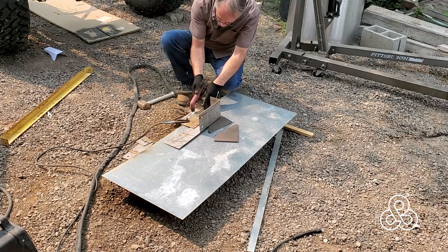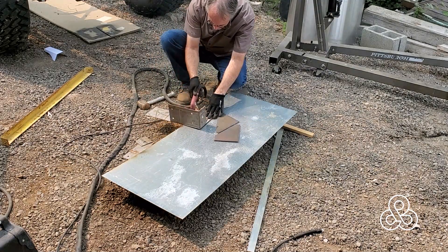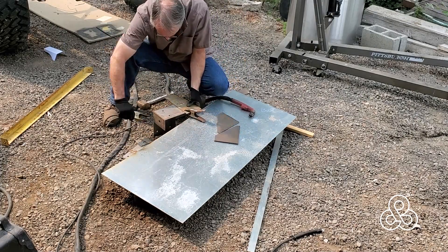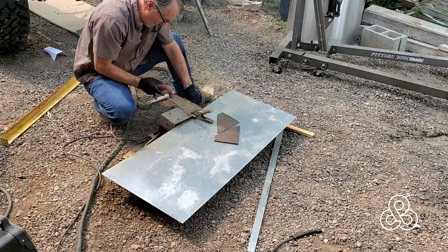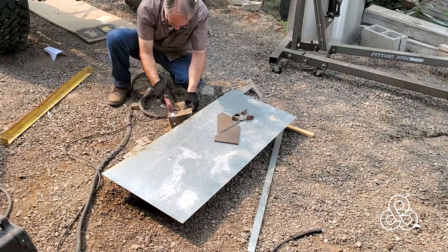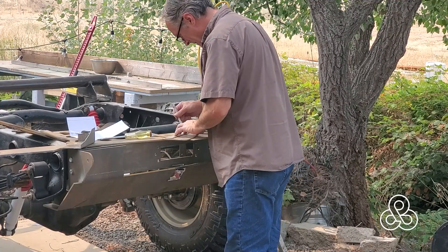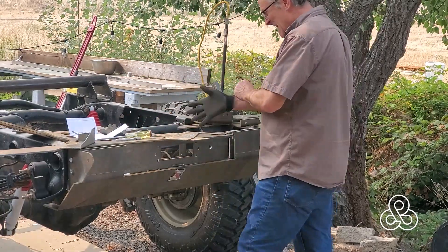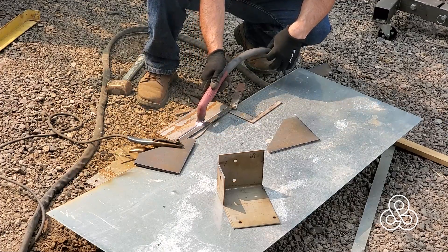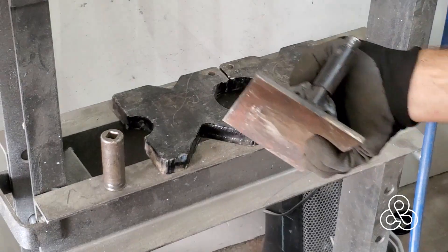To install the fuel tank, I'm going to attach it to a couple of the crossmembers of the chassis. The two frame rails are joined together by these three-inch round tubes, and I'm going to build a bracket that will hold the fuel tank and keep it spaced down at level. I had a couple of heavy sheet metal brackets built for the front of the vehicle that I'm not going to use, so luckily they were pre-bent. I'm just going to chop them up and make them fit what I need here.